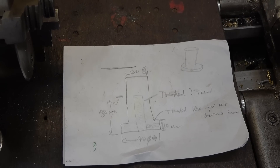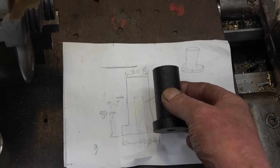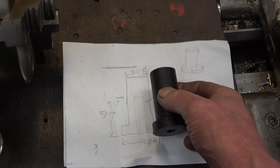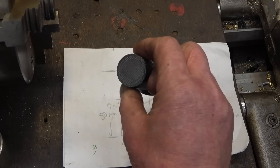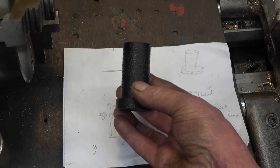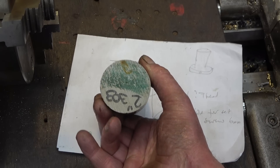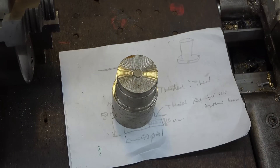I've got a nice little machine job I do here. It's an adapter for a rudder shaft on a steamboat — I presume you call it a rudder shaft. It's the bit that comes up over the hole and the bit of steel that goes on the end of it. It's actually a plastic printed part. What he wants making is to come onto this bit of 303 stainless. 303 is ideal for marine applications because it doesn't corrode and it's not too bad to machine.